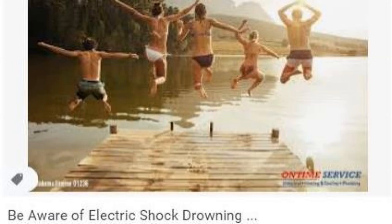This is a topic that I'm quite aware of as being a freshwater sailor, so both Pierre and I started sailing in freshwater. In freshwater, it's much more of an issue because freshwater doesn't conduct electricity. And so if there's any leakage of electricity from the boat, it's going to go into a nearby swimmer's body. Salt water takes a little bit more current for that to happen, but it's still an issue.